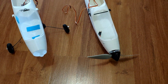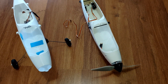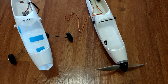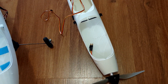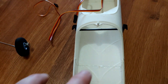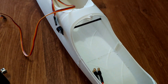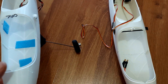I've decided to try printing it in lightweight PLA and hopefully it will go a lot better. I won't be adding landing gear - I'll try to hand launch. With the lightweight PLA I hope to get a better CG with a lighter battery. I was using a 2200 3S, I'll go with a 1000 3S. I've also added some carbon fiber tube and screwed on rubber band holders to give it some rigidity.